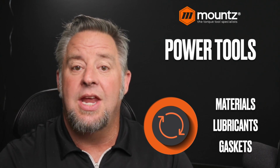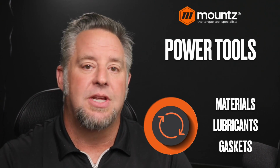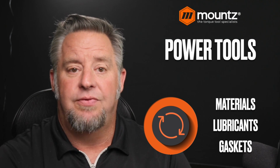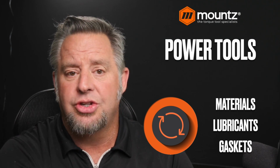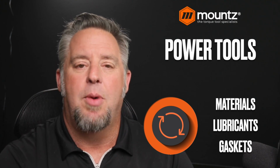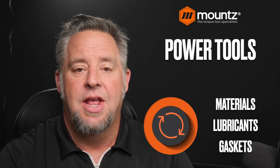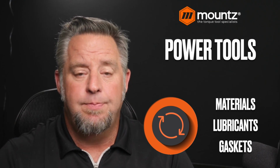And so again, the types of materials that are being used, especially if you move from maybe a metal washer to a plastic washer, all of these types of components can play a part in the actual torque output that the tool would be generating.